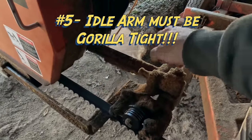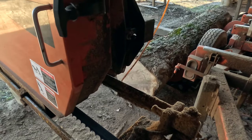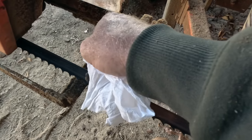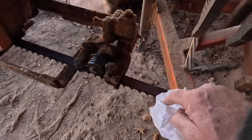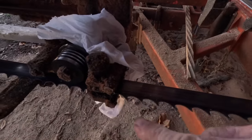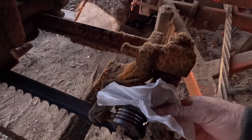Number five: the idle-side blade guide adjustment arm — the stiffness and tightness of that arm. Everything from the roller guides comes through that arm, and if it isn't right, you're not going to saw right. The only thing holding all of that is your blade guide arm. To test it: first, tighten up your band, grab the arm, and start leaning on it hard. Find a reference point and watch to see if anything moves while you're twisting as hard as you can.